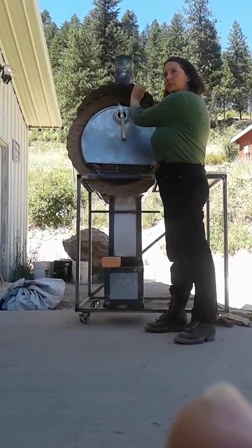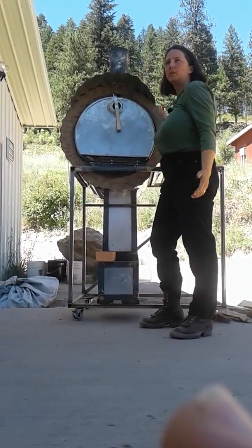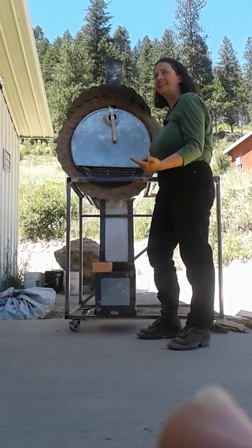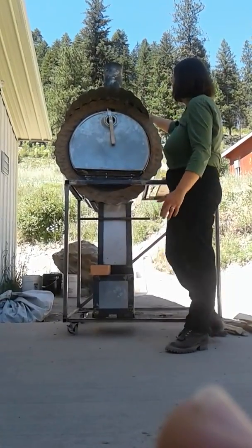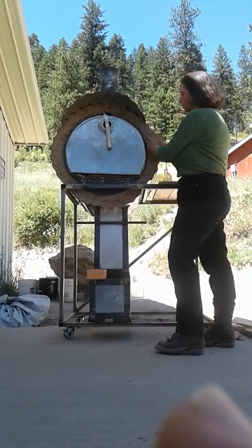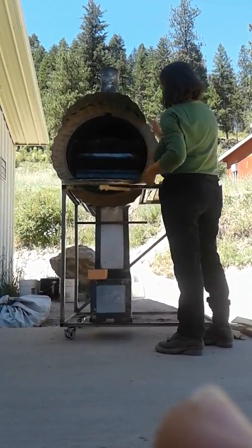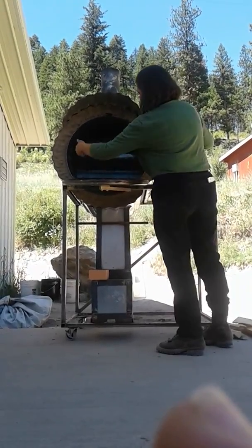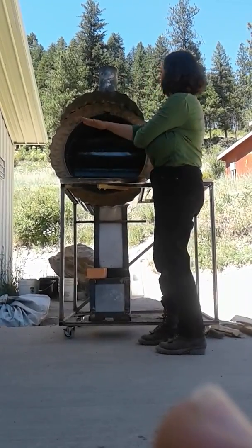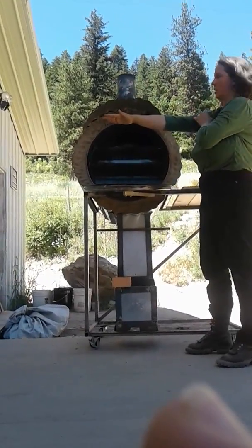It's also got a metal skin. The earlier oven had a cob plastery skin, but that meant it was sensitive — if it started raining, we had to take it inside, which is awkward if you're already firing it and don't want smoke inside. This is just a bit more weatherproof. We still have a quick cob fill so you're not exposed to the insulation. So you've got the oven skin, a second metal skin, a bunch of insulation, and then the heat goes behind the oven to get to the chimney. The oven is this deep, while the whole back chamber gives you that much more depth.